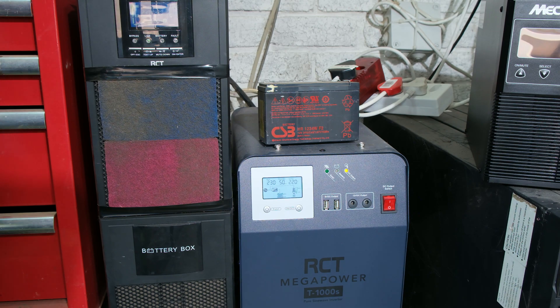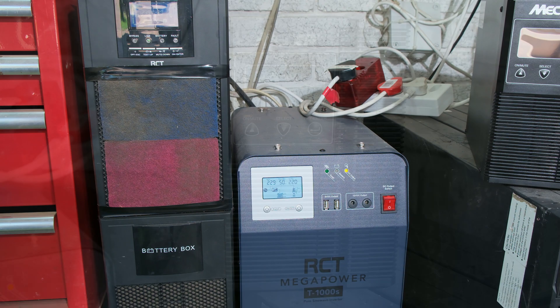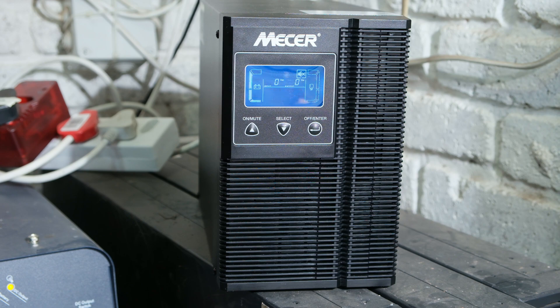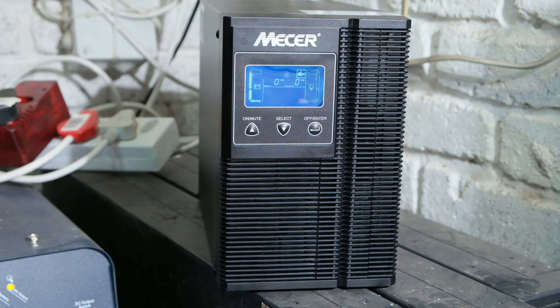The bottom line with lead acid batteries: don't let them discharge too much. Rather use them for a short time and then power off your backup system to get the longest possible lifespan. They're not tolerant of deep discharges because lifespan reduces quite a lot after several deep discharges. I'm about to loan this to a friend and I already know that in six months they'll say: 'How come the battery life is so low? When you loaned it to me I was getting three hours and now I'm getting 15 minutes.' That's what you're in for with these backup systems.